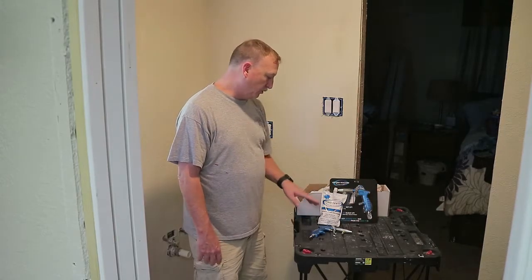To do my little bathroom, which has about 100 square feet of wall that we textured, we used 7 bags of texture. Not too bad, but that's it. That's the texture. That's the knockdown. You can also do orange peel with this stuff, but this is the knockdown texture that we did. There you go. There's a close-up on the wall. So there you have it. There's the Easy Pro texture.